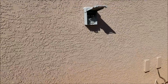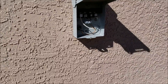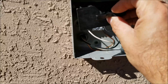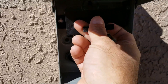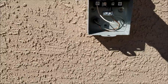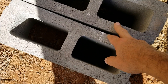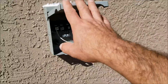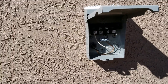They also send this little box. The one thing they don't send you is electrical, so you're going to need to buy an outlet. It needs to be on a 20 amp breaker, and I'm already wired into the garage 20 amp breaker. You pop the disconnect in one way and it turns on; pop it out the other way and it turns off — that's all these disconnects do. I've got a little whip with electrical wiring to go from here to the unit after I get it mounted. I'll put all the links in the description for what I'm doing.